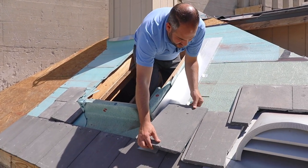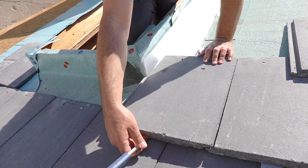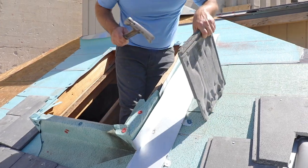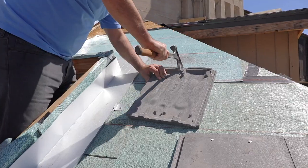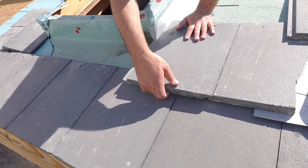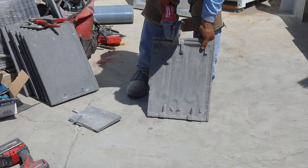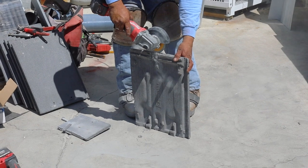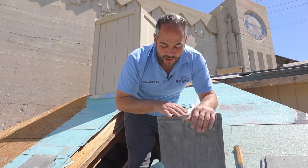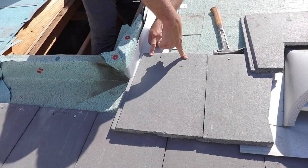What we want to do is actually notch this tile. You can see we're placing it down here, but this lip is standing up, so the tile is not sitting properly. We want to just make a mark in here — you can either use a grinder to create a notch and channel, or you can just use your hammer. You can see what we've done: we've created a little notch here, and we might need a little bit more, so we'll use a grinder to create a groove. Every tile is a little bit different — some tiles have thicker backing, some are easier to break — but the concept is the same. Make sure your tile doesn't bend down your tile pan, and we're not putting any nails in the tile pan, so make sure you're nailing outside of that.